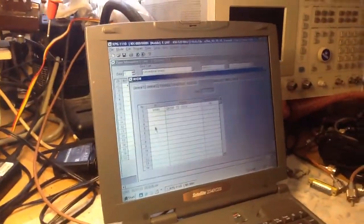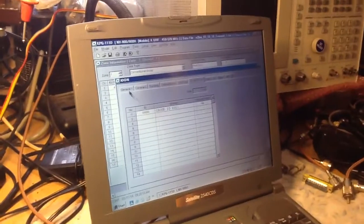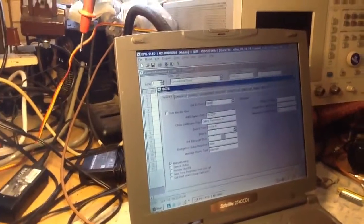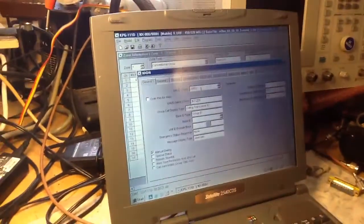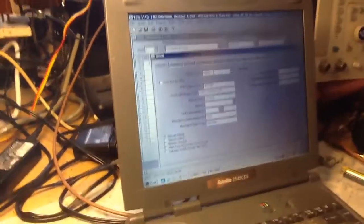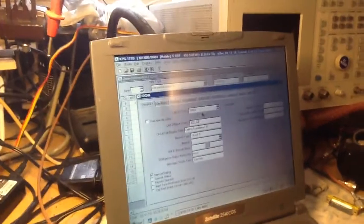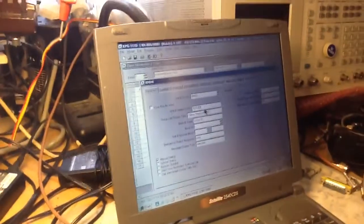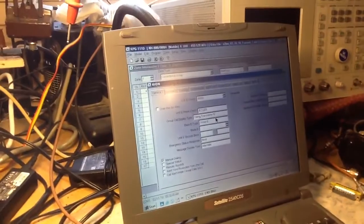You'll be listing all the talk groups here as they become available on the NXDN network. Right now we're only using 65,000. Back in the general settings, the unit ID is your NXDN ID that you registered with on that website. Most people are using the last five digits of their DMR ID — mine is 3136602, so I took off the first two digits.